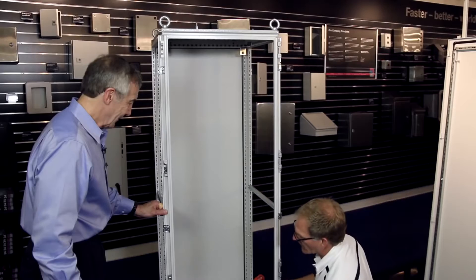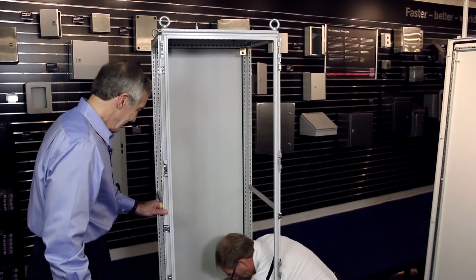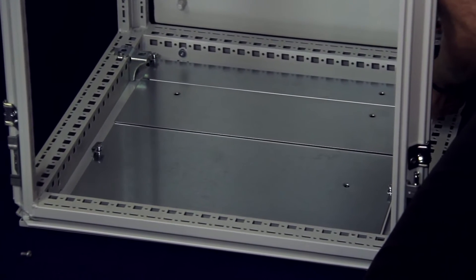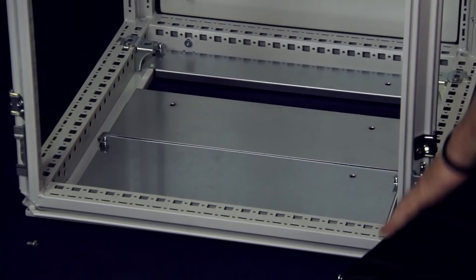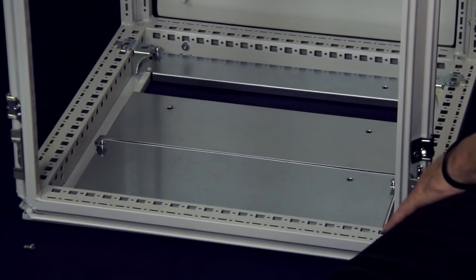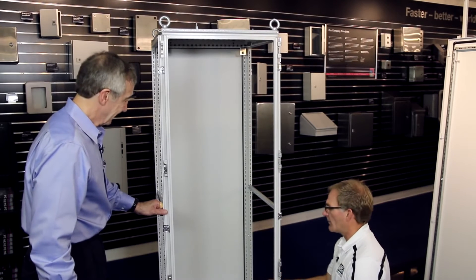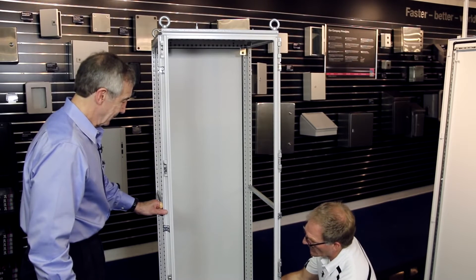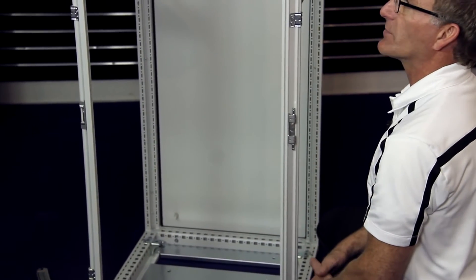You can get turnkey solutions as accessories, but the standard design lets you remove these plates or just open them up by removing small fasteners — it simply slides up. You bring wires and cables through there, add accessories on the bottom for cable management and strain relief. It can be that simple. The base is lined with gasket already provided with every cabinet, and you can rearrange the plates or make cutouts in them.